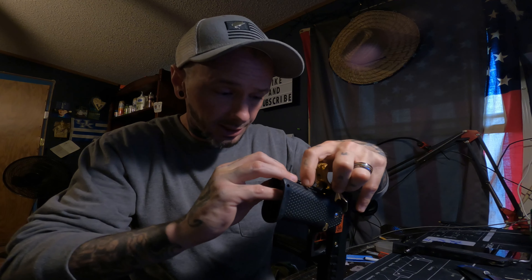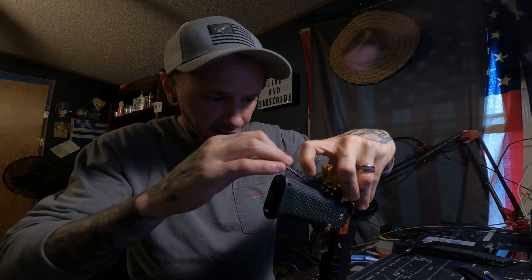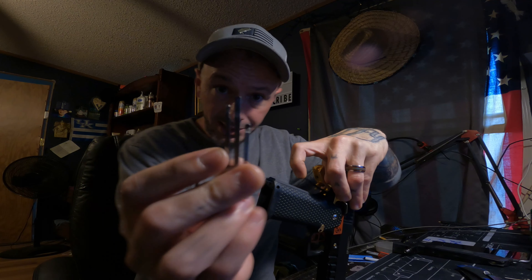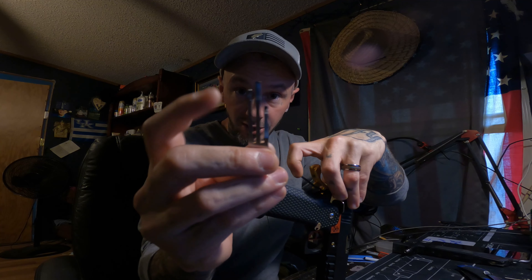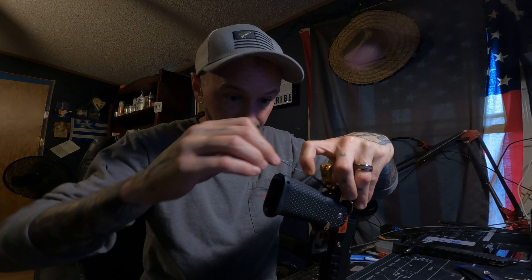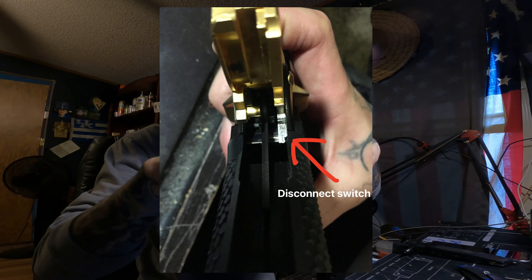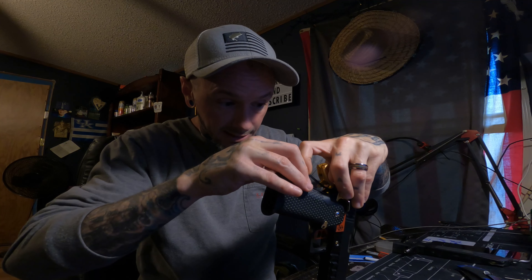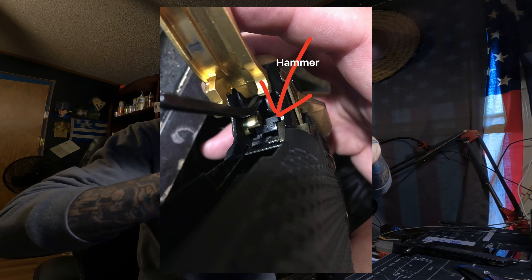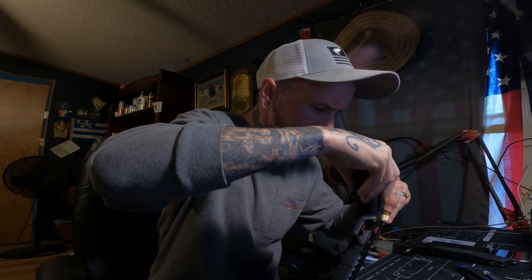When you put these back in, you need to ensure it's not on the strut. Lifting up this strut, make sure the second-to-smallest arm is on the far right for your disconnector — that little slanted piece toward the right. Here's a picture of it. Then this center arm needs to be on top of where that goes. It's kind of tricky getting in there sometimes, but you want it to sit directly on top — not under it. Under it is what will give you the issue we just had.